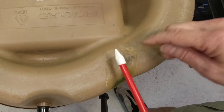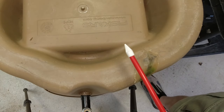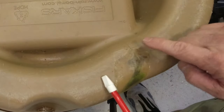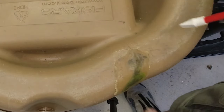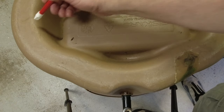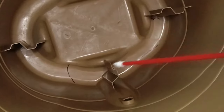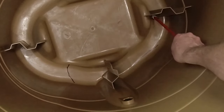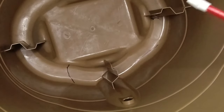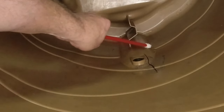This time the approach is to do the work on the inside. See, this flex tape is coming off in pieces — at least the gorilla tape was really hard to pull off. You can see right here that there's some algae growing in there. And then I found a crack here and a crack here. Using a permanent marker, I went in and did some outlining of where the cracks are. So those are the ones I'm going to be hitting with flex paste. Using the marker allows you to give a target of where you're going to have to start the flex paste and where you're going to stop.